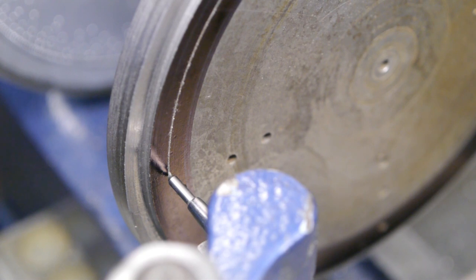So this bolt circle is about 12.5 millimeter from the outside. That probably is a little bit of a measurement error. It's pretty hard to measure from the outside of the chuck to the middle of a threaded hole, but this should be close. And I can always drill the holes a little oversized, that shouldn't matter. I probably have to, because the bolts are imperial and I don't have any imperial drill bits.